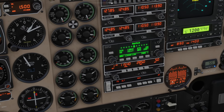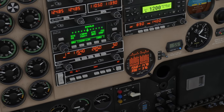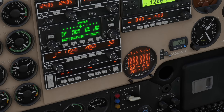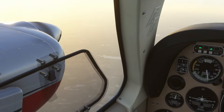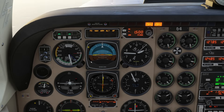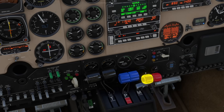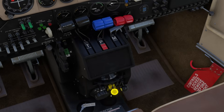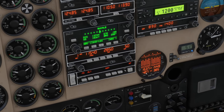As a general rule with these engines, 390 is the limit. Now you might think: I'll solve this — I'll slam open my cowl flaps, that extra airflow will fix the problem. Well, let's take a look. Did you notice the cowl flaps are no longer effective? Remember what I said earlier: there's less air up here, which means less air flowing through those cylinders, and because my speed is lower, I'm not getting the same cooling performance as at lower altitude. We can actually help control this by re-enriching the mixture — you can see my combustion temperature coming down substantially. I've got my cowl flaps opened as wide as I can, and doing everything other than changing the plane's speed, and I'm just barely starting to get this temperature under control.